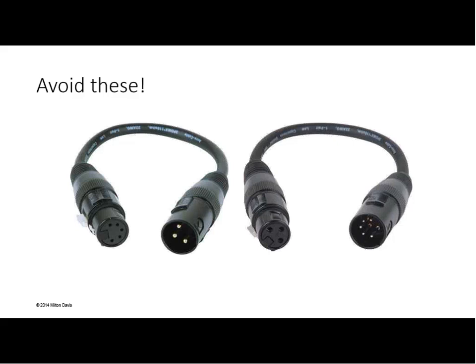Not only does DMX risk damaging the audio equipment by blowing out your speakers, the audio risks damaging your DMX equipment via high voltage phantom power. That's yet another reason that the 3-pin is cross-plugged. If the phantom power exceeds the common mode rating of the RS-485 standard, it can and will blow out an entire line of DMX, the console and everything on it, if you cross-plug into phantom power.